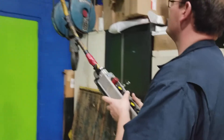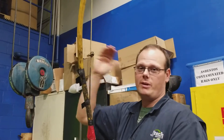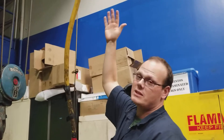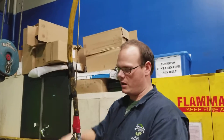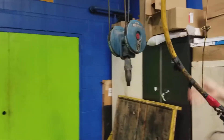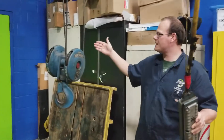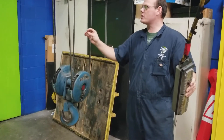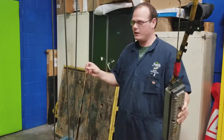For demonstration purposes, we will actually function this crane. There are a couple things we need to check for in the operation of the crane. We need to make sure it stops on both ends — it has a limiting stop. It goes and stops, doesn't hit the wall. It goes up, stops, comes down and stops. Those are the big four stops that this thing needs to do automatically. We'll get the hook closer to the ground and see if it stops at the bottom. This is usually a program safety switch — there will be some kind of slack on the wire rope and it will turn off. While you're doing this, it's a good chance to look at the wire rope for nicks, cuts, and over-greasing.